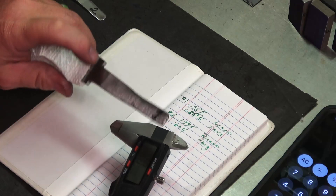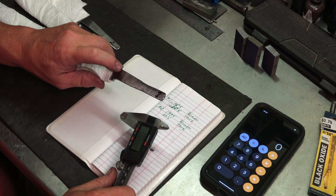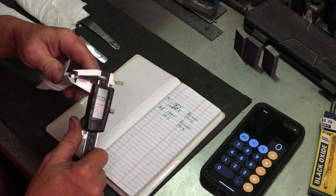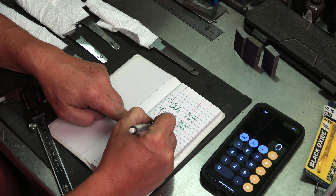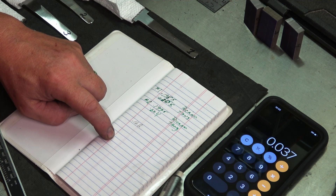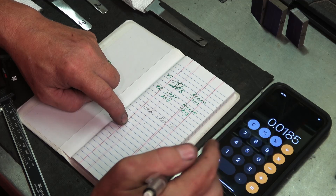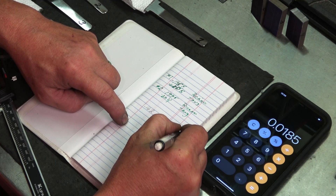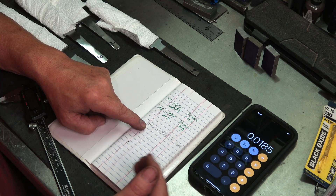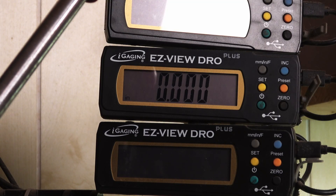This is going to be a press fit guard — I won't be cutting a chamfer for the guard to rest against, so I want a very tight fit. It'll be hammered on most of the way after it gets about 1/8 inch from the shoulder. First I measure the tang: .162. That's our target. Using a 1/8 end mill: .162 minus .125 equals .037, and since we're taking off each side we divide by two — .0185 off of each side. I'll set the X DRO to zero and move each side that amount.